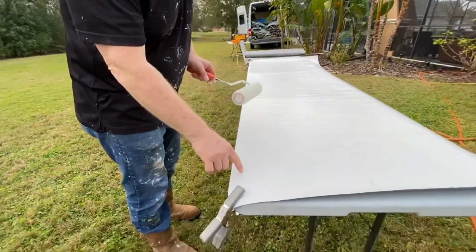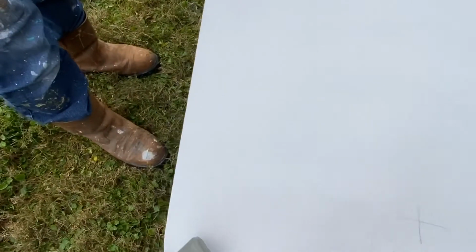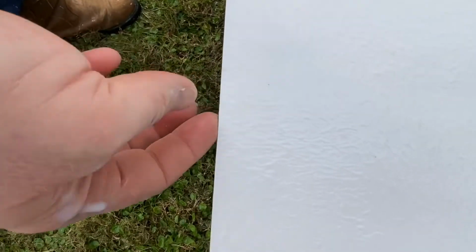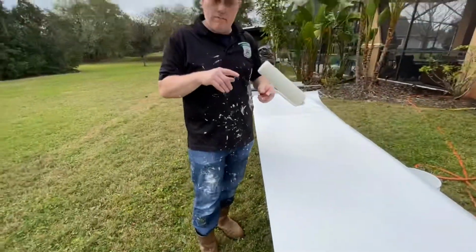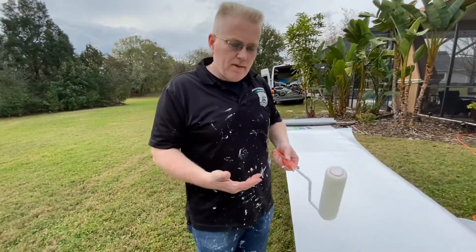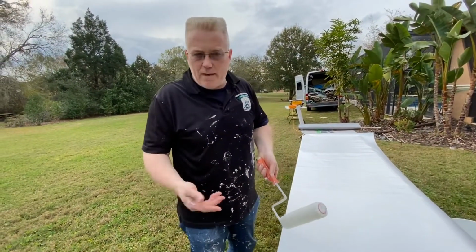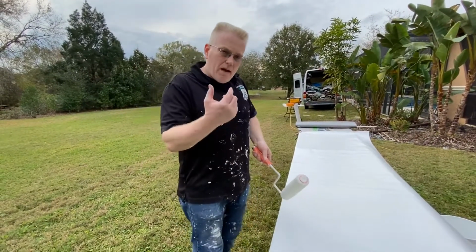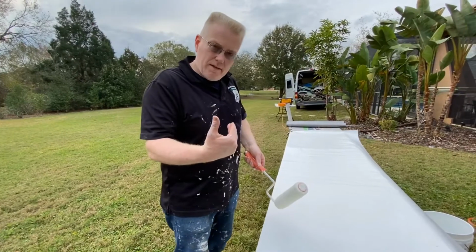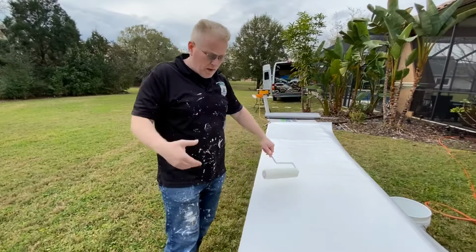Look at the wall covering. Put the camera, please, right over the wall covering. You cannot see my table, can you? The reason is because if you do, that means the table could get glue on it. If the table is exposed, then surely if I go to take my wall covering off, I'm gonna hit the table, I'm gonna get glue on it. You always wanna hang the wall covering a few 16ths, and I'm talking about 3/16 of an inch, over the table.